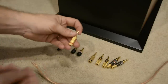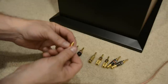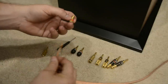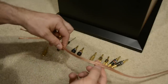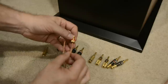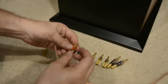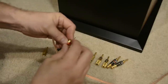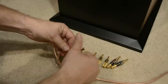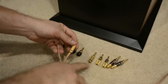The next set is the Cable Matters - they're very similar to the Monster Cable. You unscrew the base. These are a little different because there are threads from the bottom all the way up to almost the top. Feed the wire through - we can see this wire is white, follow that up to the tip, and that one's going to be our red. Feed it up through the bottom just like we did on the Monster Cable. You can't fold it down too far because if you get it over these threads it won't screw on. Try to go all the way around as much as you can, then slide the tip on and tighten it down. Give it a little tug, and do the same thing for the next one.